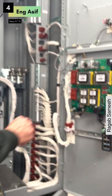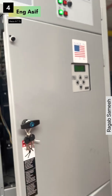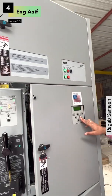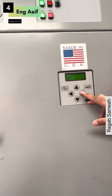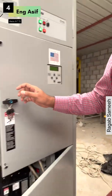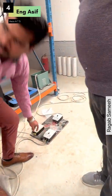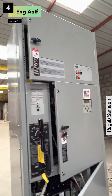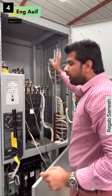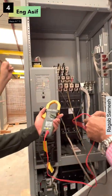So now it is clear on the normal. Now I will turn on the emergency. Now we have power on the emergency. Now I will turn off the normal. Then one and two will close for the engine start — meaning you fail the normal, so it will give a signal for the generator to start.